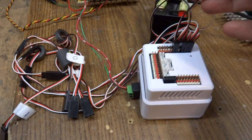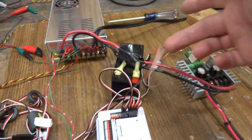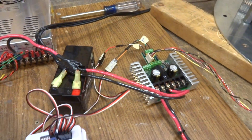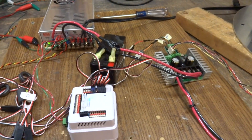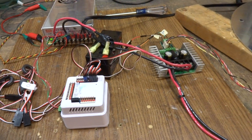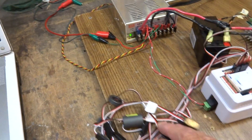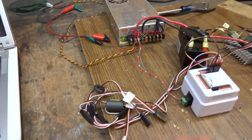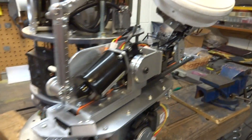I'm going to be using all three UART ports on this one for the various motors that I'm going to have on this mechanism. So I thought I'd set up the rail system motor for using UART 1. This is UART 0, UART 1, UART 2 is over here. And because of that, I only need these two cables right here going into the Kangaroo to handle all the motions of the positioning and speed on this thing.